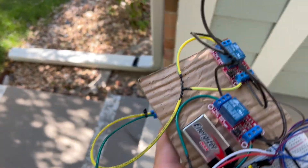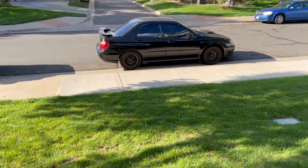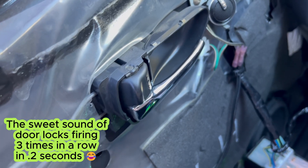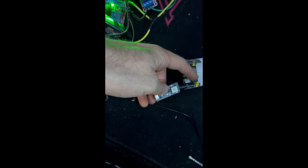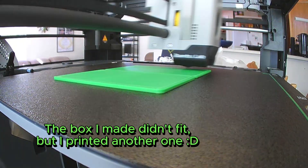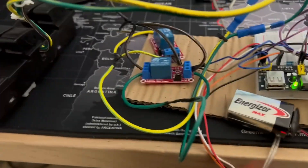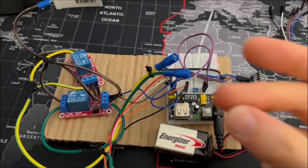It's not perfect but look — you can carry it in one hand. I was bending these a lot and this broke loose. This Arduino when I turn it on is showing a red light — I think it just died. While I'm waiting for that I'm just going to design a little box to put this in. All set up, ready to go. I didn't show it but I actually took these cleaned-up versions and just installed everything in the door. One more final thing to note: I actually used a 12-volt to 5-volt buck converter. The 9-volt would only power this for about 100 hours — it's better to run it off the car battery, so having that step-down to have the Arduino run all the time is great.